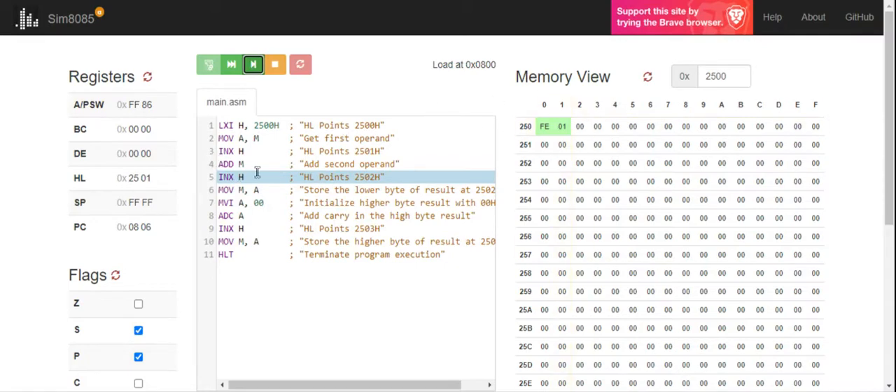This FF has not moved to the output yet. To move it to the output I need to point to memory location 2502. So I increment HL again — 2501 becomes 2502. Then MOV M comma A moves the accumulator value FF to memory location 2502. So the value at 2502, which was 00, is now replaced by FF. No carry was generated, as you can see, but the program will still handle the carry.